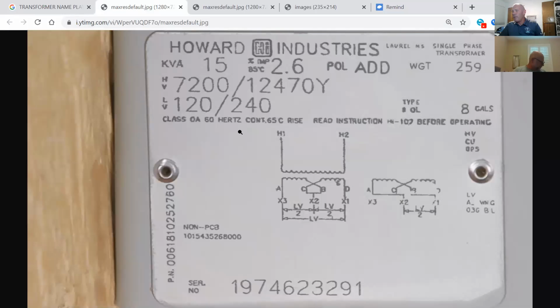All right, we'll go through a couple more things here and take another break on the transformer nameplate. We did talk before about being sure that when you pick up a transformer out there in the field, don't trust what's painted on the transformer. Usually they'll have information painted on the front of it, like company number and kVA, and sometimes they'll actually do the voltages on the transformers.